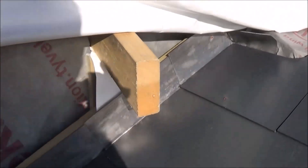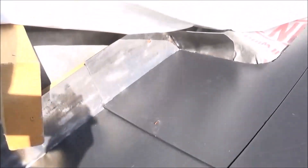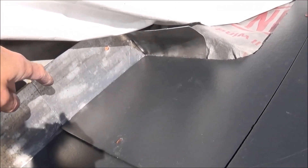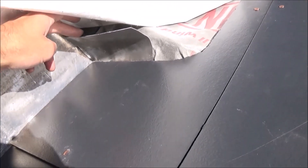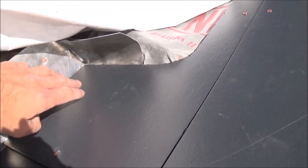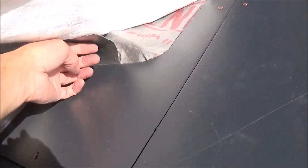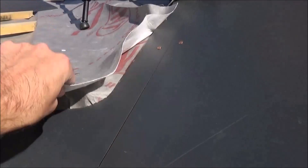Because the view was a bit poor from up there, I'll just show you the lead soakers. Going from the bottom of the cheek of this dormer, I've worked my way up. When you get to the top one it's a little bit shorter. I've put a trim down the corner, turned it around the back and folded it up. All this is going to be behind the fascia underneath the soffit, but if you get any water ingress it's just going to turn it back and bring it back down the roof on the slates. This bit here will have the lead valley going up, which we'll see later. So it's another day — we're back at it, going to try and finish slating this rear dormer roof, cut a few slates down to size, get them up on the roof, and hopefully fit them into place fairly quickly.